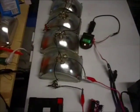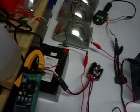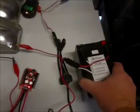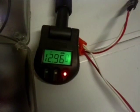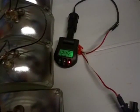I only got a tiny bit extra with the second set of bulbs — not sure if it's the batteries or a solder issue, but the nice part is the current limiting works well. At around 3 amps it will charge this battery fairly nicely. These portable 12 amp-hour batteries are heavy but not like a full car battery at 50 pounds — you can run portable electronics from them. The dead battery's voltage is slowly rising because of the 3 amps being pushed into it, and it will eventually equalize up at 14 volts for a charged battery.